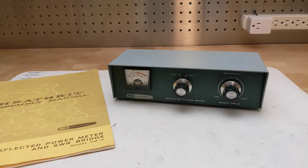The HM15 was and still is a basic SWR meter that does the job it was designed to do. Offered as a kit, it would have been significantly lower in cost than commercially assembled units. It was a relatively simple kit — a magazine review from the time reported a total build time of 1 hour and 20 minutes, and it didn't require any test equipment to calibrate. It lacks the ability to measure output power, something the later but more expensive HM102 could do. It needed a reasonable level of output power, making it suitable for most transmitters of the time but not for QRP transmitters under 10 watts, except on the higher bands. I also own examples of the Heathkit HM11 and HM102 SWR meters and have made YouTube videos about them. Thanks for watching — if you enjoyed this video, check out my other YouTube videos on vintage Heathkit amateur radio and test equipment.